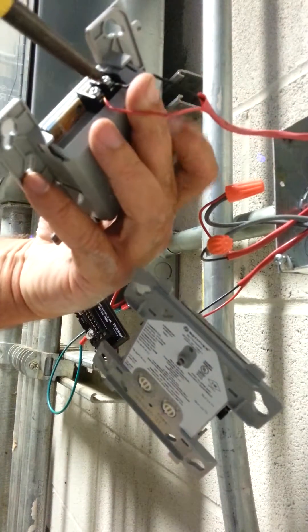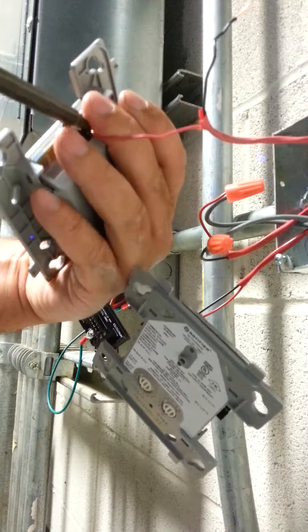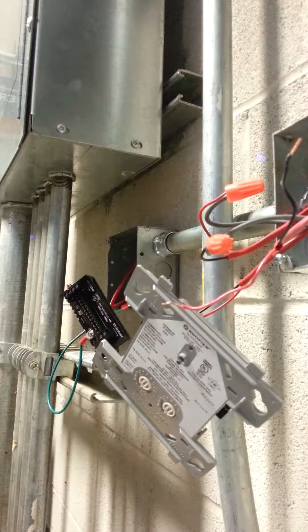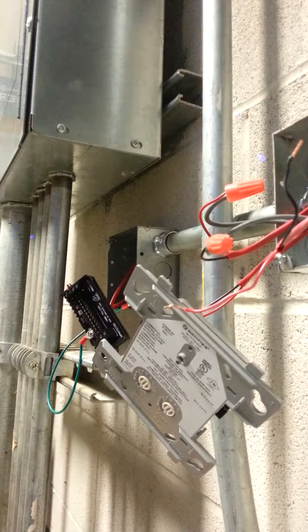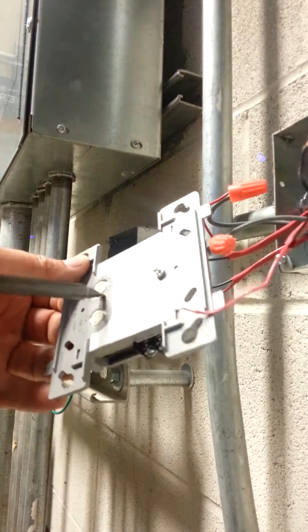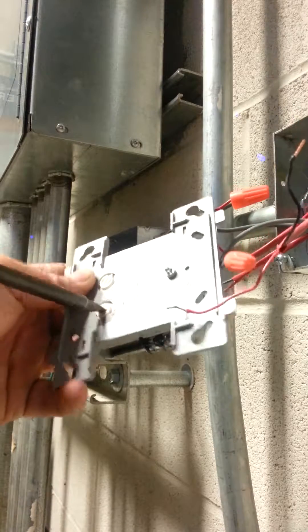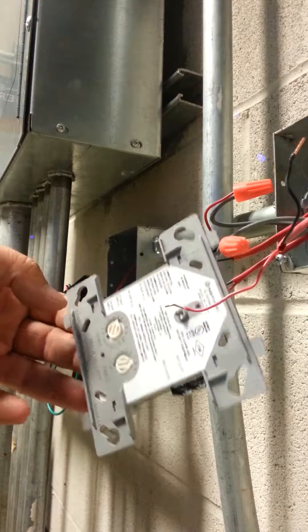Something like this is pretty simple, straightforward stuff. Any time you're cutting these wires, if you wanted to cut them off so you can leave the color underneath the spades, cut them one at a time. That's the panel you hear beeping in the background — just saying it lost SLC 58. What I'm doing here is addressing it. There's a tens wheel and a ones wheel, so 58 would be tens to five, ones to eight.